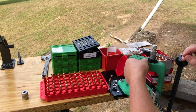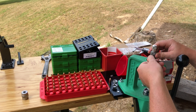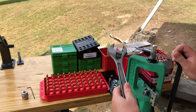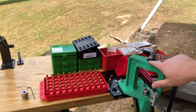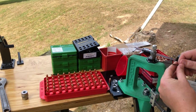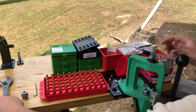I'll lower the ram a tiny bit and continue to gently set the die down, then thread the lock ring down. Double-checking the round to make sure we're not excessively crimping — which we are not. That looks good. Double-checking in our case gauge — looks good. What this did was set up the crimping portion of the die, which is adjusted by moving the die body up and down. Using a hex key, I tighten down that pin. With this style of lock ring, tightening it down cams the die against the top of the press. I mark the set screw position between the L and E on the Lee die, gently crack it loose, slide it back, and tighten down the set screw to retain our crimp setting.